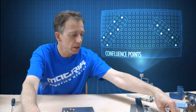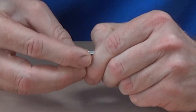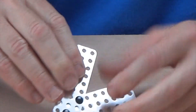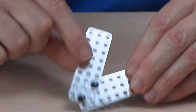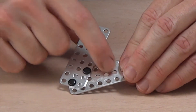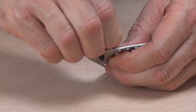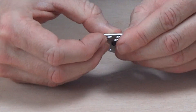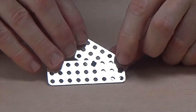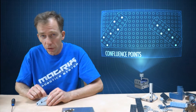It lets you put things at this angle even with just two holes together. For instance, I can take these two beams and establish that angle right away — just two beams, two pins, and I have this angle. This is in fact the exact same angle as what you would get in a 3-4-5 triangle — about 53 degrees, the larger of the two angles. I can also make the sharper angle of the 3-4-5 triangle: in this case, I go up 3, down 1 on one side, and then over 3, up 1 on the other side.